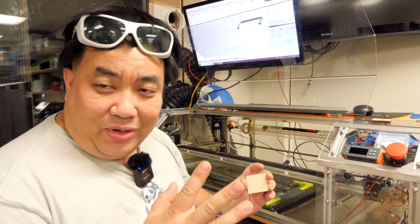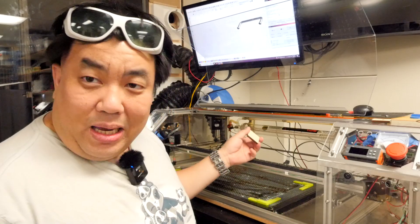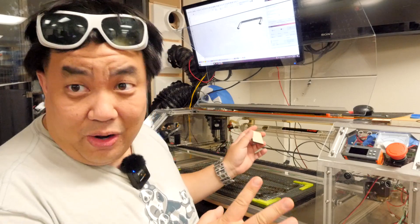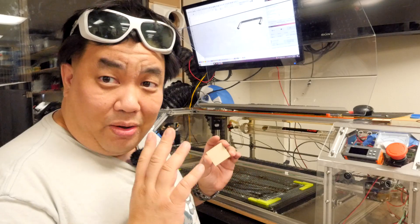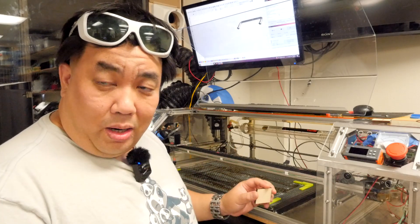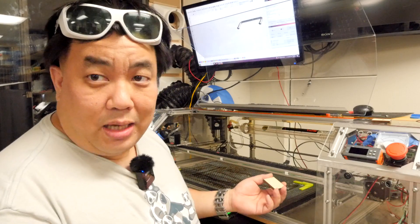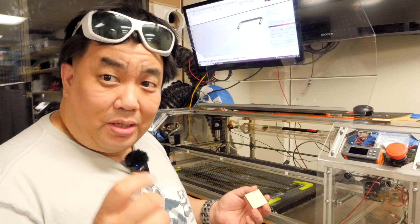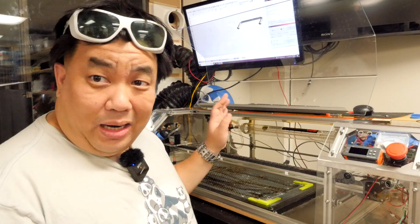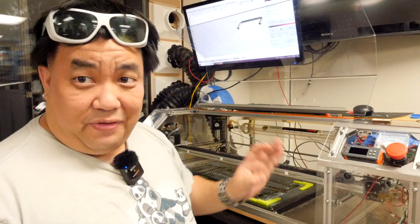So it's absolutely bonkers to me when I see people work on dialing in a laser without wearing laser safety glasses. That beam is invisible, so you can't see it. You will feel it if you get in its way, but you can't actually see it. It has about 100 times more power than the class 4 threshold for lasers. A class 4 laser will cause irreversible eye damage faster than the blink reflex can set in, and that beam has about 100 times more power to do that. So you absolutely should be wearing laser safety glasses.